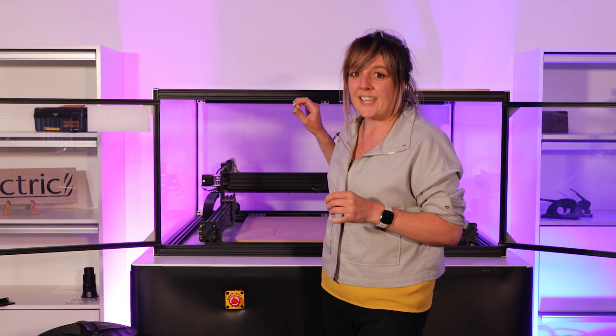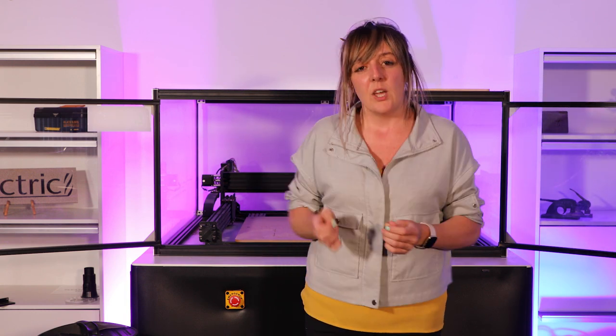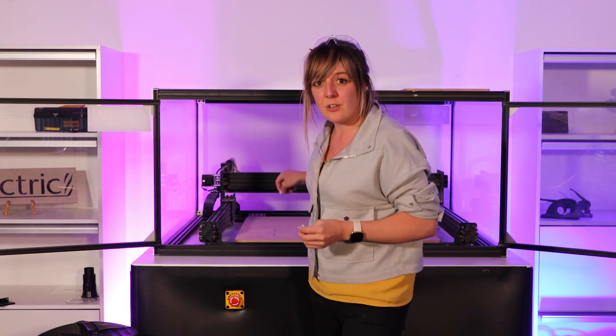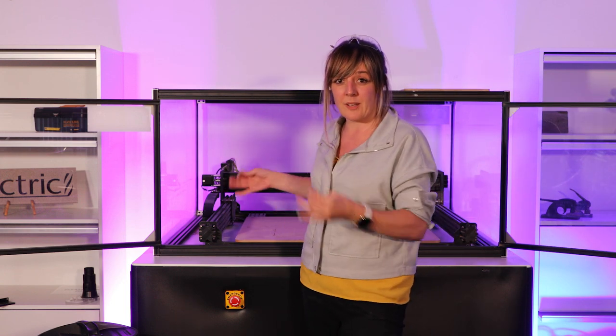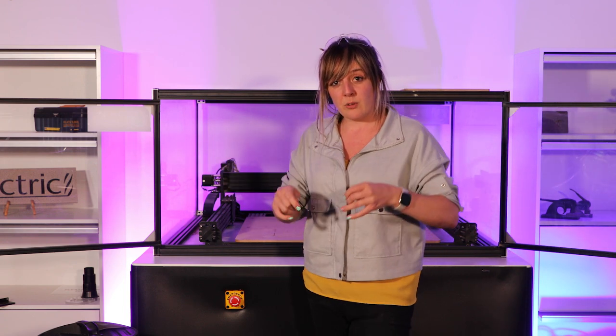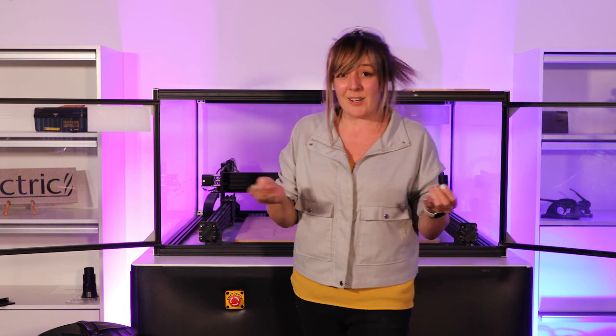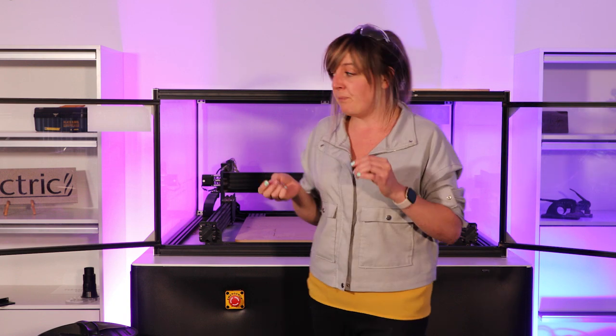Okay, so the pocket toolpath has been done for our dowel. So I've got three dowels. I'm going to put those dowels directly into those holes in the spoil board. I personally prefer to do it this way because I feel it's easy to actually locate your material onto the board rather than have the pins in the board and we're locating to the holes underneath. But really, that's personal preference.